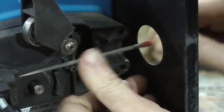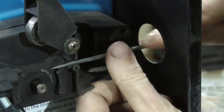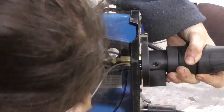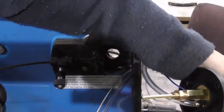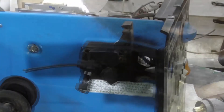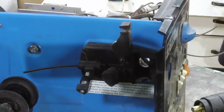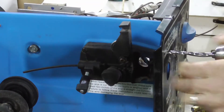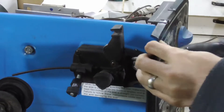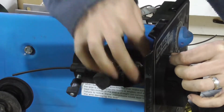This thing's got to go there. Had to manually file this bit — couldn't reach with anything else sensibly. Do the marker thing and cut this thing down to the right length. Mark a hole for the top bolt to go through. Some people put a little reinforcement plate on this as well — I didn't, and I would recommend it because the whole thing is a little bit flexible after. The casing for this welder is quite thin, but hindsight is a wonderful thing.